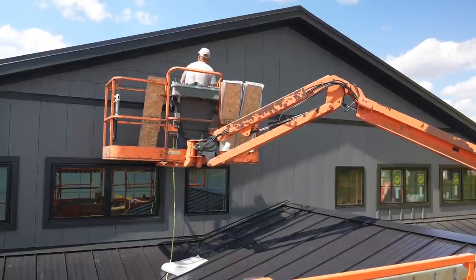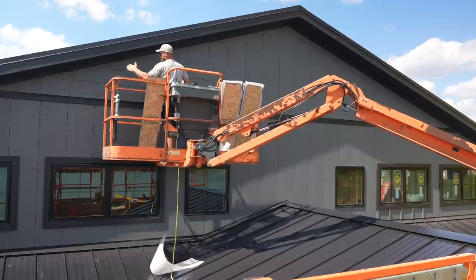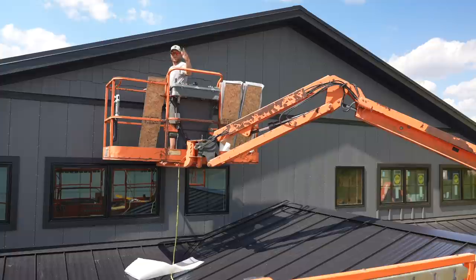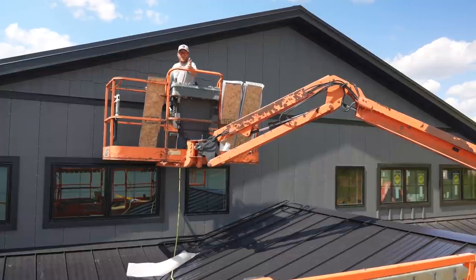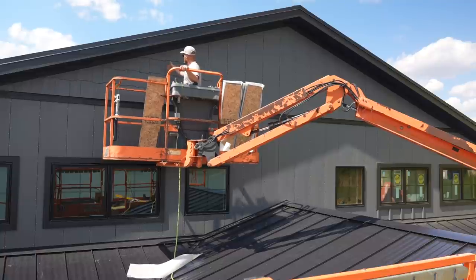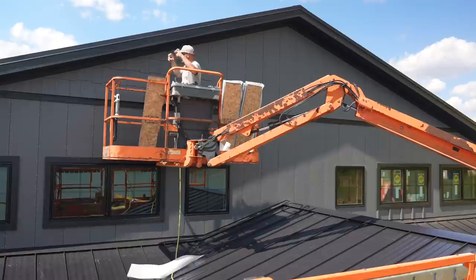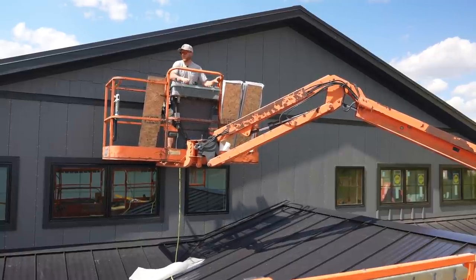Now that we have this stagger here, basically what I've done is taken 16 inches off of each one, because on a natural flat square wall, not a gable, you want to go 16 and 32. If I were to take 32 off a piece, it would just be a little tiny corner, and that doesn't really make much sense. So I wanted to see what this would look like. This is three pieces with 16 inches off, and this one doesn't line up with this one. I don't see any pattern specifically, and it might patternize or randomize a little bit, but hopefully you shouldn't see it.